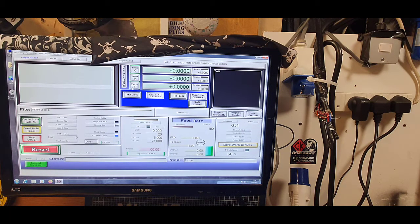On every single cut it goes down, it will touch the metal and lift up. I have it set at 1.5 with a Jasic cut 45. Obviously the thicker metal, you need to work that out, but like I said on my previous videos, the tools that are set up on my SheetCam, all that takes into that consideration, and you can edit all the code in there to which you feel right, which is a lot of work, messing around every cut, but obviously once you get it right, pick your metal and you know which tool you like. So like I say, you'll see it lift and rise on every cut.